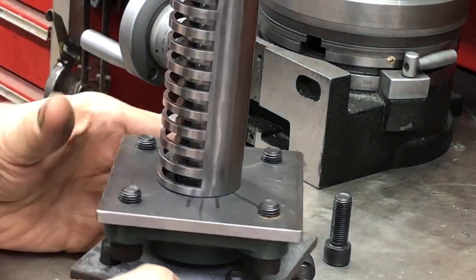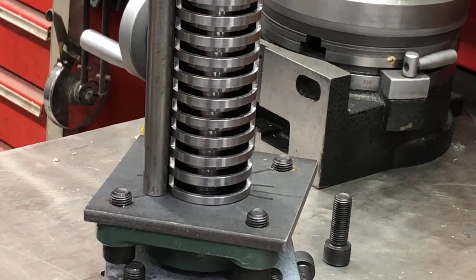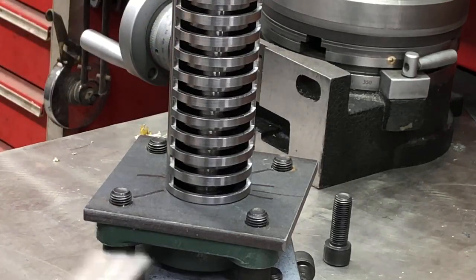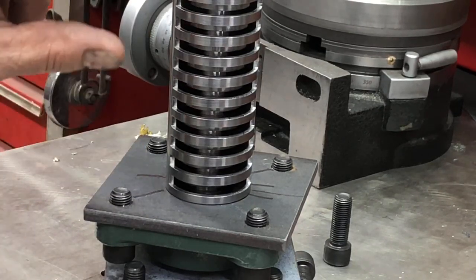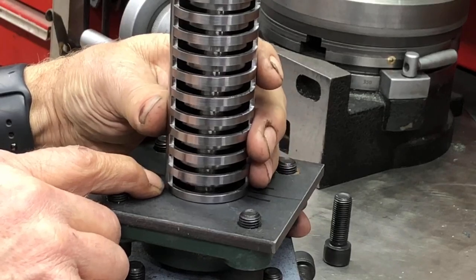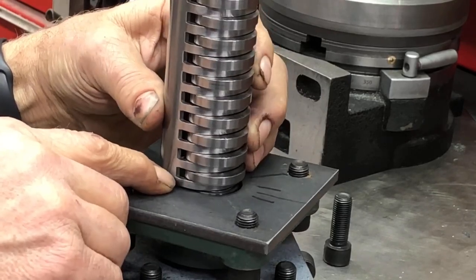So if I take a pin and put it right here and drill a hole here, and drill a hole on the other plate down there in exactly the same spot, so I can slide a pin down through there, and then I have a seamless tube welded on this edge that the pin fits very precisely down through the middle of, I can make this guy pivot on this pin, and by turning it, it's hard to do in your hand, I can actually rotate it to about there.